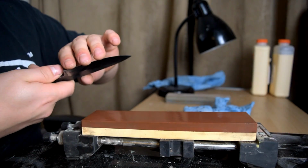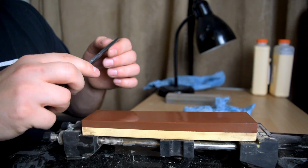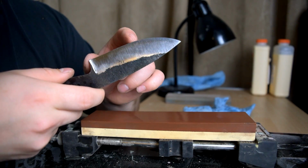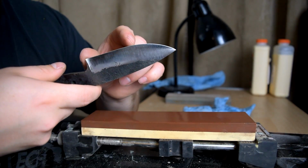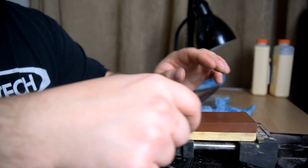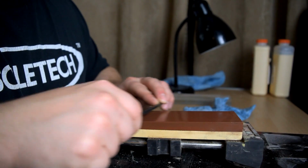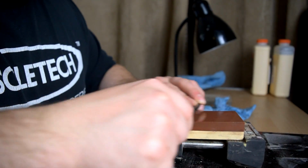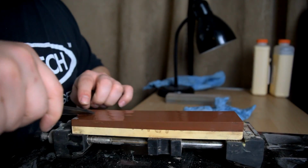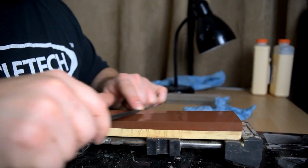This bevel turned out exactly like I want it. For me in a knife, I want some straight edge, perfect straight, no recurve, definitely not. I want some straight edge, and that's this portion here, which is plenty, and then I want a nice long belly. Nice long belly to my blade, and that makes it nice for feather sticking or nice for food prep. It makes it nice for working on animals. It's just a great, for me, I think it's a great setup.